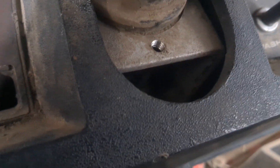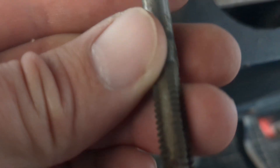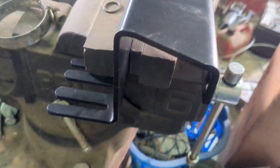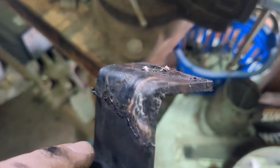The gap between the two pieces was a little too large, so we had to modify it. I tapped and threaded that hole so we'd have something to attach to. I used a 5/16 by 18 bolt and had to use pliers because there's not much gap to spin it. So here's the original piece and here's what we modified: we cut it off, put a new bend in it, re-drilled it, and put a hole right there.